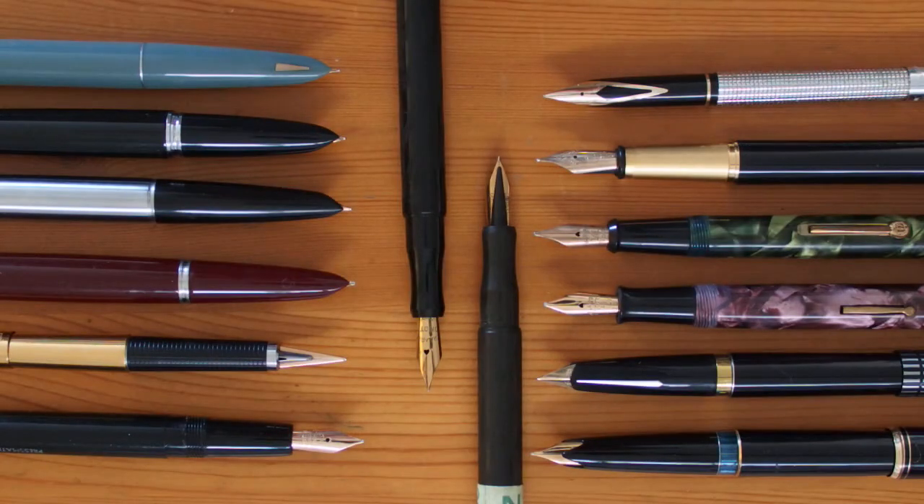This expectation was still present when the fountain pen came along. As the fountain pen nib is constantly wet with ink, which might even be somewhat corrosive, they had to use gold for the nib — a stable material which does not corrode. So the early fountain pens had flexible gold nibs, simply because of two different requirements coming together. Be aware that pure gold is a ductile material; if you make a nib out of pure gold, it would be easy to distort but cannot recover to its original shape. Other materials have to be added to alter this characteristic, so the gold content varies. Along with manufacturing processes employed as yet another factor, this can give nibs a variety of physical characteristics — hard, soft, or springy — but this also applies to steel.